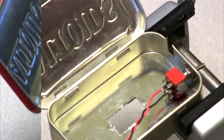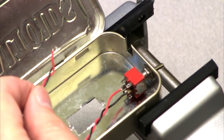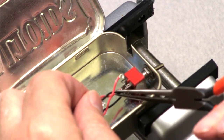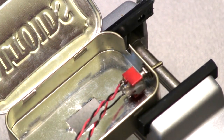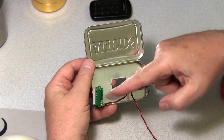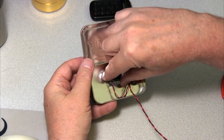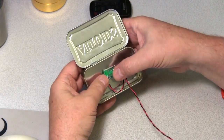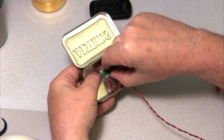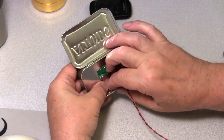There's the black. Now on the other side of the switch is my longer red-black pair of wires. I'm going to do the same thing — connect those to the top lugs on the switch and pass them through. So I have the wire soldered to the meter and two wires soldered to the switch. I'm going to take the meter and stick it down through the hole. The hole's kind of snug so it'll probably hold it. The wire's fighting me a little bit — there it goes. It's in there, and I'm just going to push the wire down to the side.